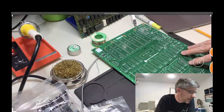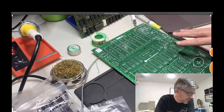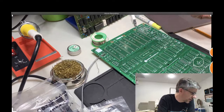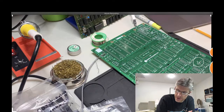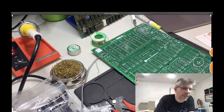The key question is which order to do things with a kit like this. Typically for kits like this — and when I did the Mockingboard or the Phaser kit — it's usually best to start with the shortest components so you can lay them flat, then build up from there. The trouble is if you start with something like the edge connectors or some of the sockets, then when you put in resistors or capacitors you won't be able to press them flat when you flip the board over.